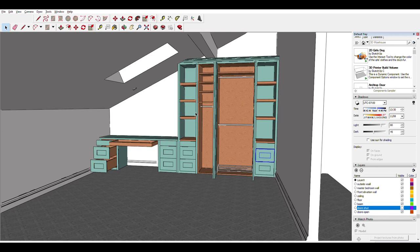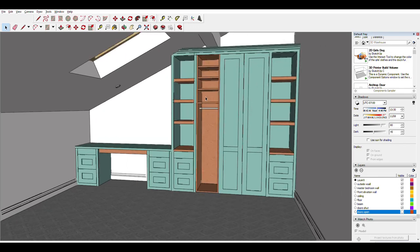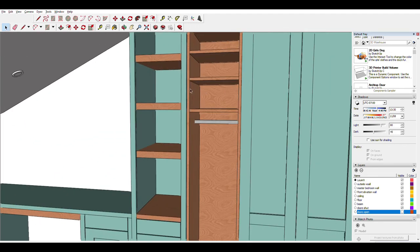Then from that point, we get the price agreed, and then I can do what is essentially a construction drawing. Now, you could look at this drawing here, and take the tape measure tool, and measure a door, and it's 401. But I couldn't make a door at 401 because there are so many moving parts. There are drawers here, rebates for the lights on the shelves. If I remove that door, is that going to be a half overlay, a full overlay, or an inset face frame for the hinges?